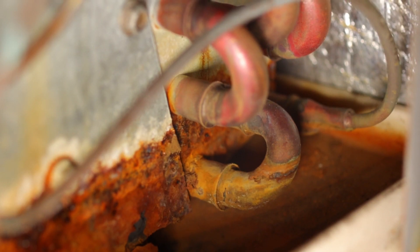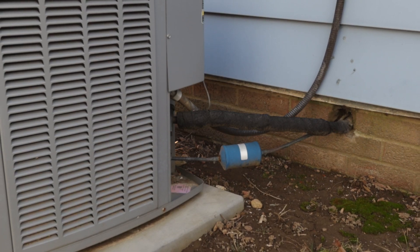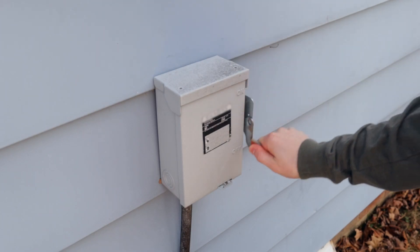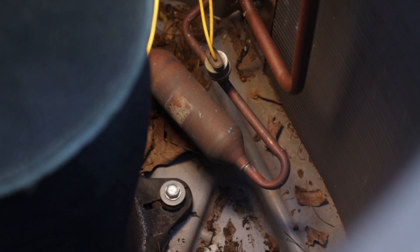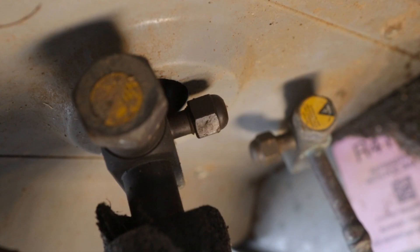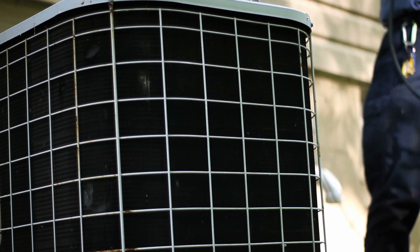You should also look for corrosion or ice buildup, as these can be an indication of a leak. On the high-pressure side of the system outdoors, there are a few components worth checking for signs of leaks. There may be a leak if the capillary tubes on the suction line have oil on them, the accumulator has rust around the base, or if the service valves have oil on them, unless the system was serviced recently. Removing the gauge set can often leave oil behind.